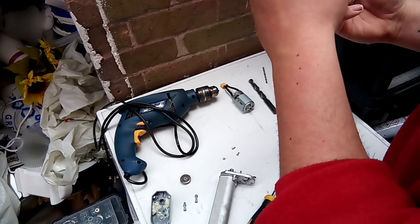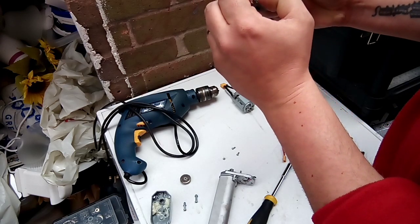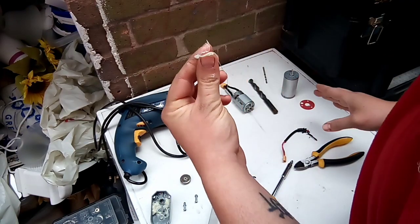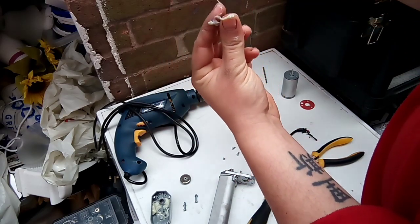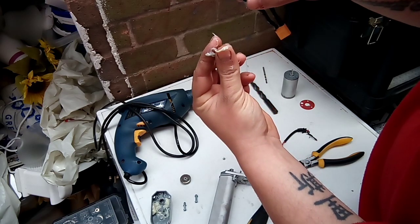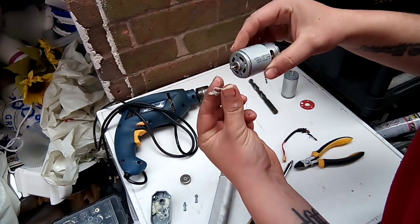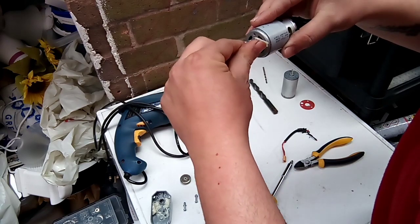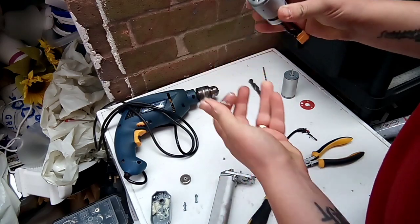So there is our not very good motor. The pinion gear — all the ones I've taken apart are D-shaped ones. That should relatively easily pull off; use some pliers if you need to. Now the motor you're going to be sticking it on — if it doesn't have the D-shaft already, you can file it down so it will fit. I've pre-filed this to save time. So now see how it fits on the end of there — I'm going to put it on. Ta-da!